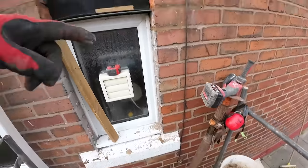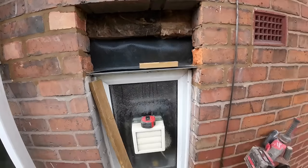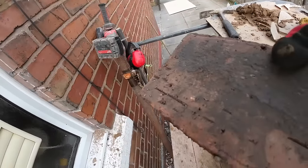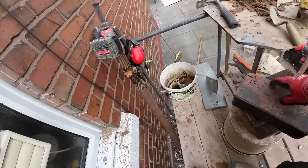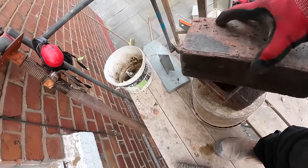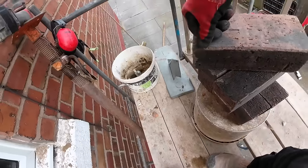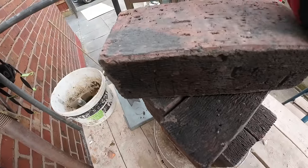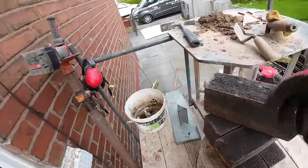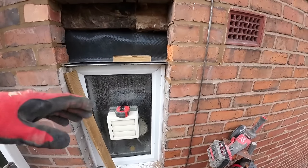And also, we're going to put big perps in and get rid of a brick because these were that tightly perped. I've never seen that, they never even got mortar on the back there. They just spread the front, ridiculously tight. See, no mortar, just a sliver at the front. And when they've been raked out, they've actually ground them so the joints are bigger. So terrible, really. So we're going to put nice big perps in, which is fine because it's on the side and it's also more balanced.